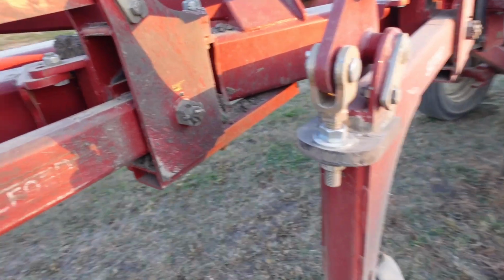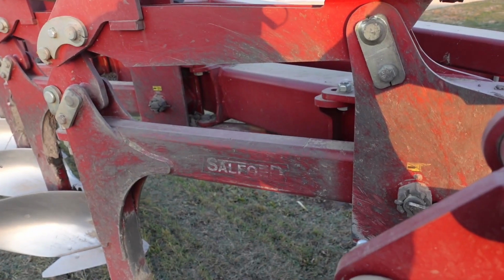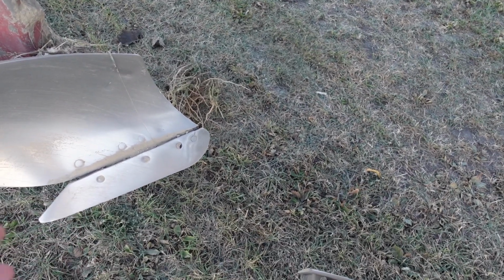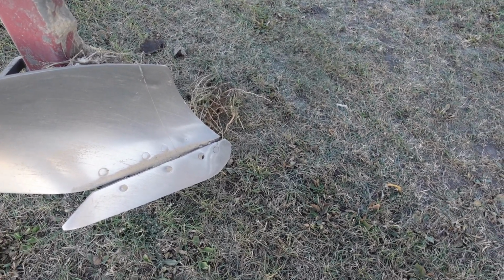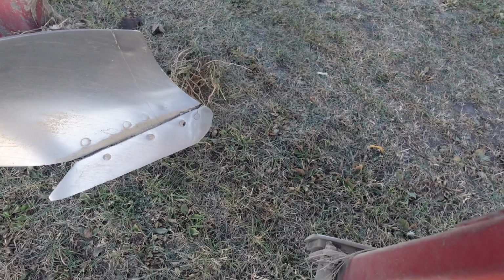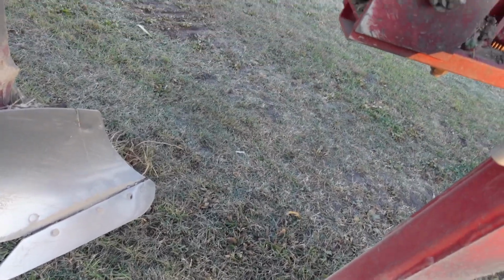These can trip up, like they'll just extend straight like that, and the plow won't be in the ground. If that tooth is off or bent back or something's just wrong, you'll be able to tell pretty easily looking back if it trips up and stays up. Sometimes they trip up because they hit a rock or something. So yeah, that's a little bit on the plow, or I thought I covered it decently. Just a quick rundown of everything, and there's obviously more stuff that I'm forgetting.